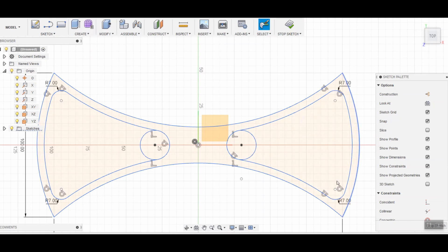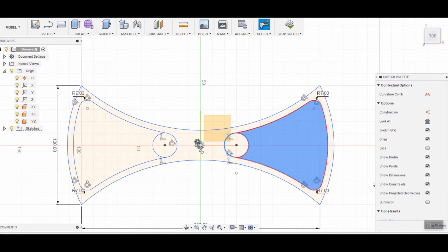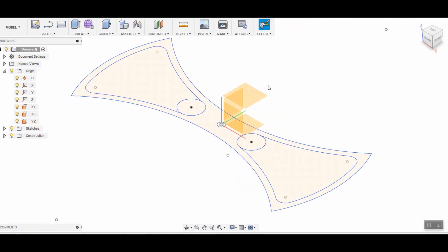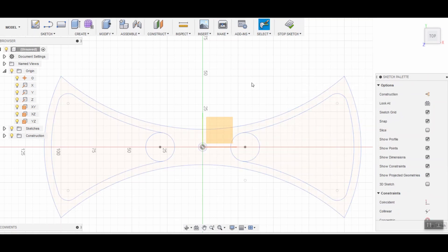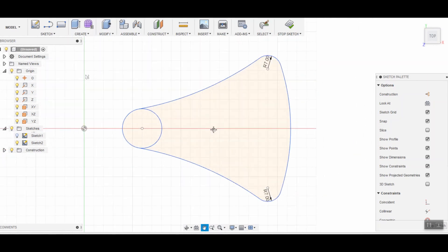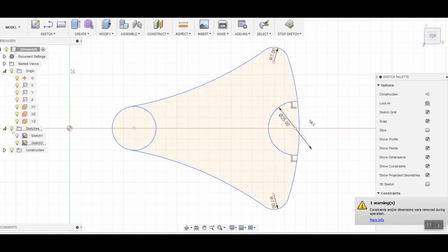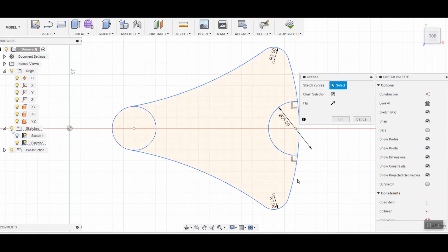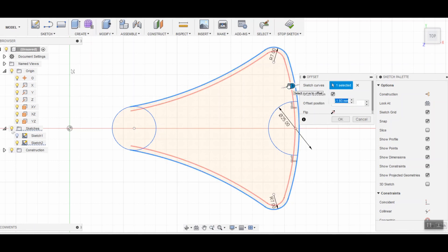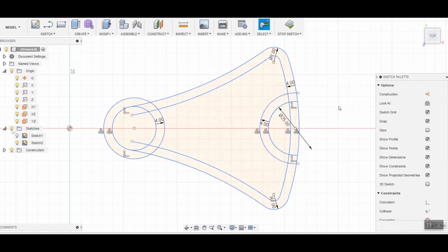So the first run I'll use plywood. I would have to make a couple of changes to this model - I made those changes further down the road. Those sharp corners of this main plate, because it's plywood, there's no way to make them look nice - they'll be chipping inevitably as the end mill passes by, so I'm going to round them up.